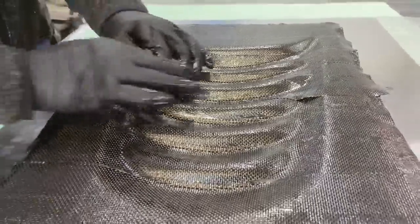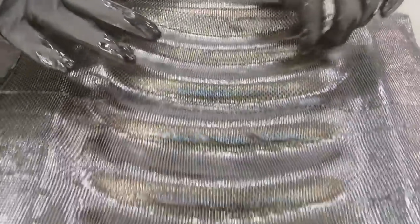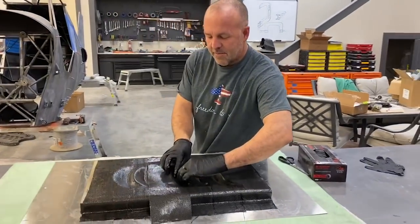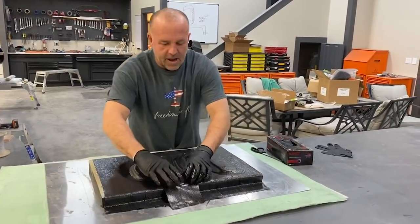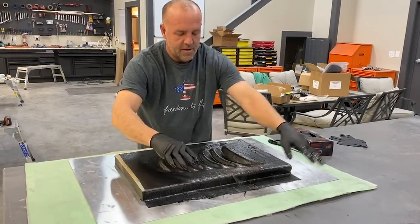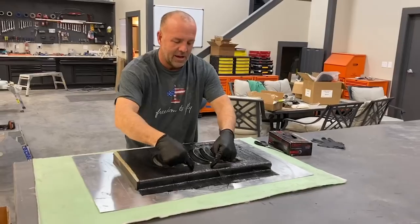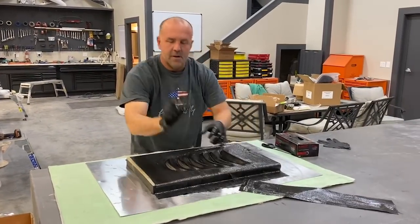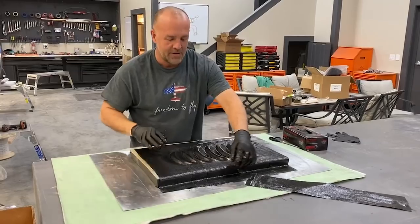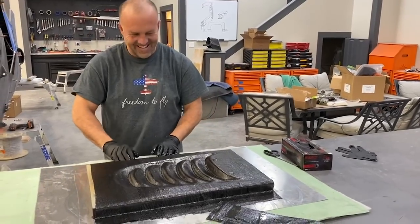All right guys, we're on our second set of shark fins. This is the air outlet for the oil coolers. And I'm also working at the same time on the start of the avionics panel. So, some of the subframe, I need some 90 degree angle carbon fiber, just a hard 90. On the last part, I ended the part up here, but whenever I need a few 90s, I just run it long. And when I bag this down, I'll have a 90 right there and another 90 right there. So I can get two small 90 degree carbon fiber parts at the same time I'm making this part with really no extra effort. So 3 parts, price of 1. Best deal ever.